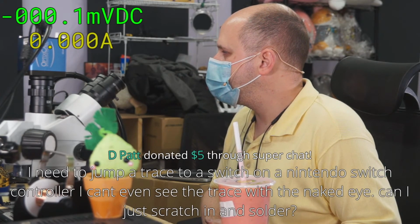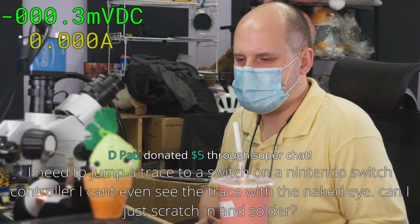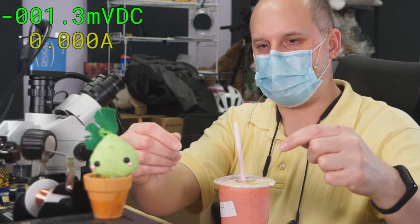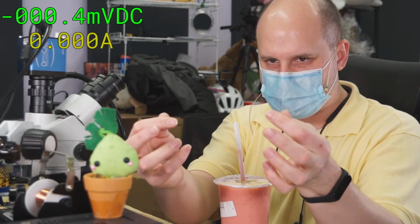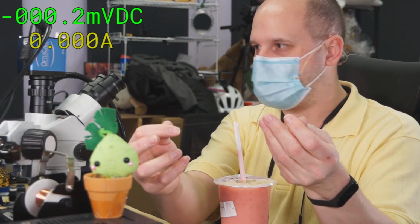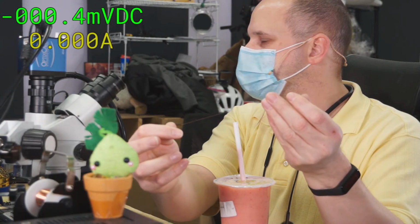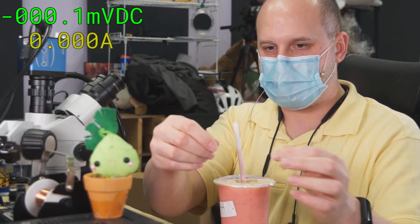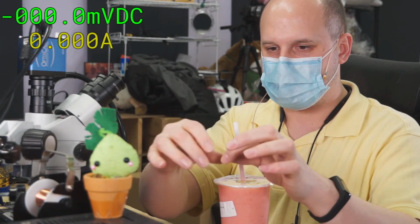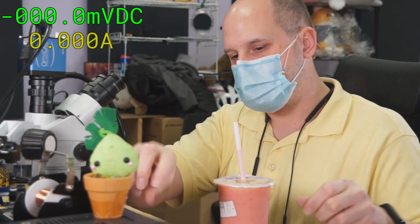And yeah, it all depends on what voltage it is. What does it look like? Like you say, you can't even see it with the naked eye. This is the 44 gauge wire. It's a little bit thinner than most human hair. That would be somebody with thin hair if they had stuff that big. I can actually see it on the monitor too. It's tiny, and it's coated in an enamel, so it looks like it's bare copper, but it's not. It won't short on anything that it's touching unless you scrape away at it with a soldering iron and tin it first.